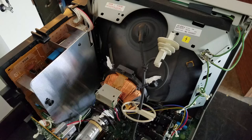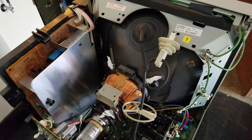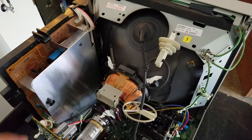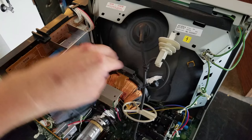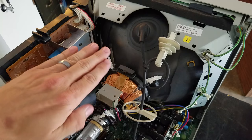We're back here behind our actual running monitor. Our yoke is slightly different but it's just this black piece right here — this is what we're going to adjust. As you can see, it's got these points here that we talked about on the other monitor and they've just come a little bit loose right under there. So we're going to move this until that picture on the front side looks level.